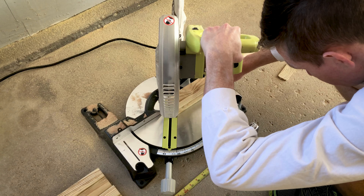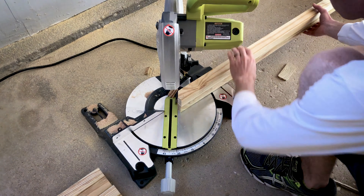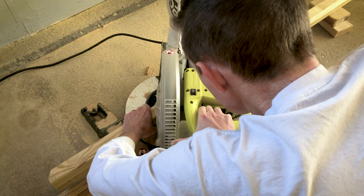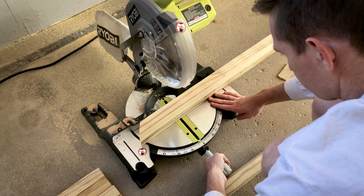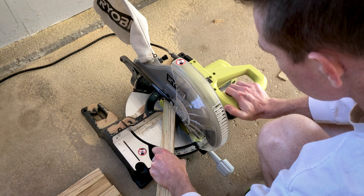This makes the rest of the project run much more smoothly. In this project I need to create an X within a 9.5 by 11.5 inch rectangle. This works out to where I need to create a 40 degree angle squared off with a 50 degree angle, so the end of each piece will be centered and square on each corner.